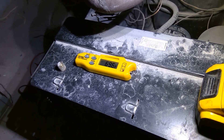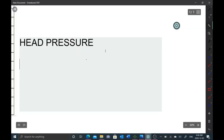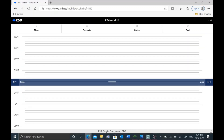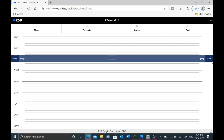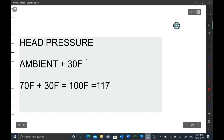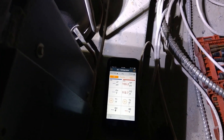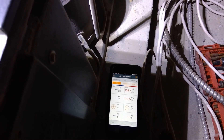My ambient temperature is 69.4°F. To figure out our head pressure, it's ambient plus 30°F condenser split. So we have 70°F ambient plus 30 gives us 100°F. Going to our PT chart at 100°F, we should be at 116.9 PSI — let's call it 117 PSI. We have 155 PSI. We should be at 117. Head pressure is really high.